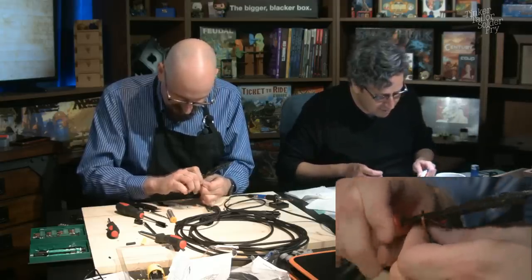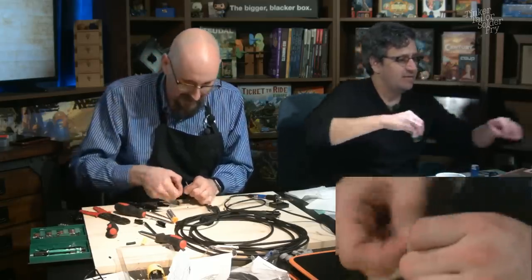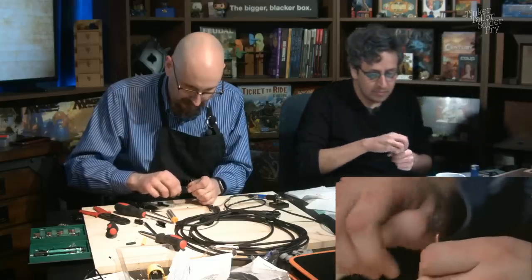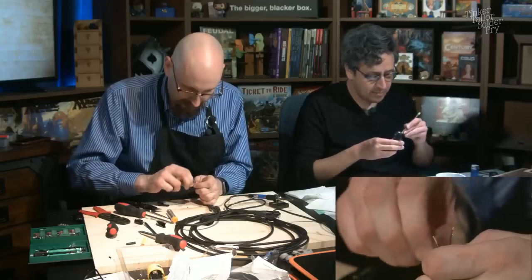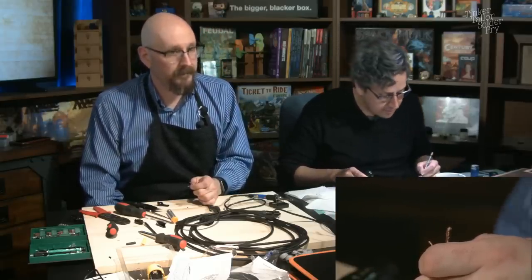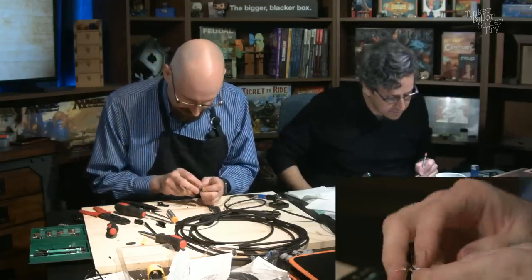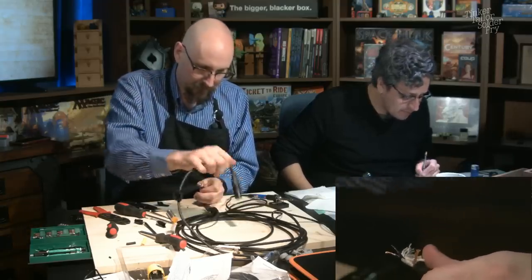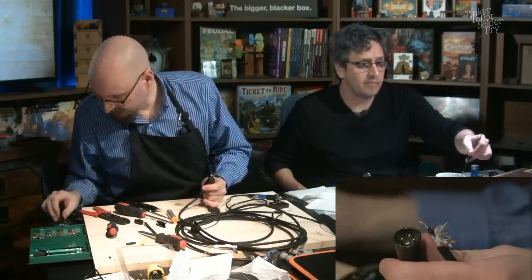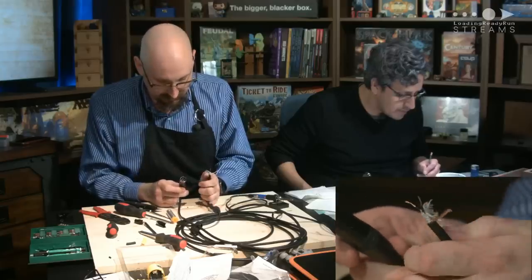How did this cable short out? I can give an educated theory. Naturally, when I'm winding a cable, I gather as much of the cable as I want, take it into a dead area, and basically drop an end on the floor. You just kind of string everything out, and then you end up dropping an end on the floor. You feel around for where the cable wants to wind, put a half turn into it, and go back and forth, over, under, over, under. But inevitably, whenever I'm dropping cable to do something, I never hold both ends and drop the cable to the ground. I take the end that I need, and then I drop the other end on the ground. Generally, that's the other end Ian's holding, the one that goes in the camera. I'm never dropping the one that I'm going to plug into the boom.